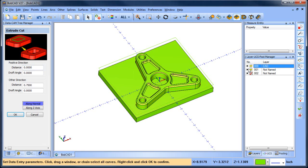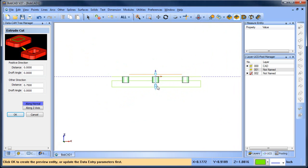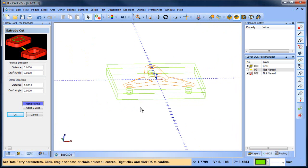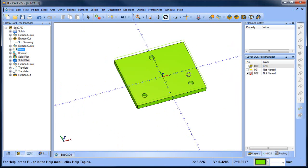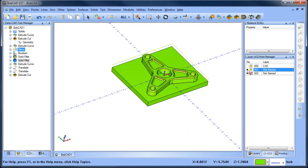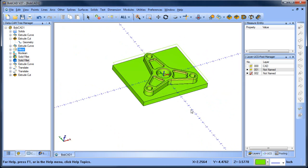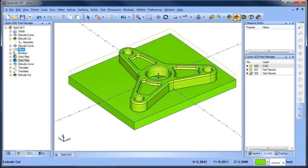Let's turn the solid layer off and select this one, this one, and this one - we're going to cut some holes into the part. Now we have some holes. Let's turn the CAD geometry off. Those holes are going to represent tapped holes or pins or whatever you're going to use. We'll use this subplate to hold the part as part of the machining process, because we want clearance all the way around. We can bolt through those holes and hold the part in place.